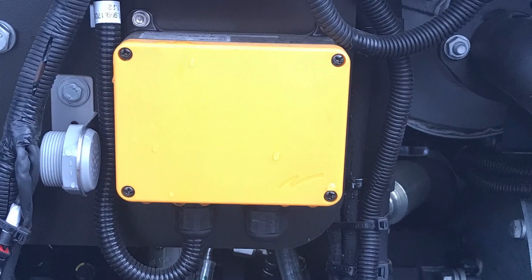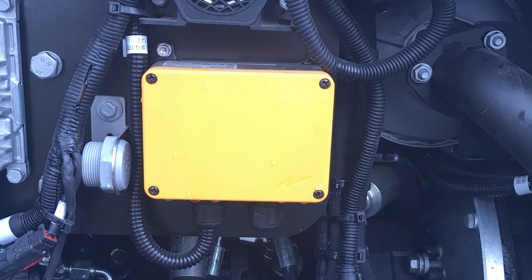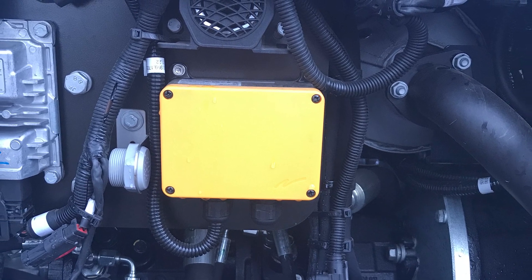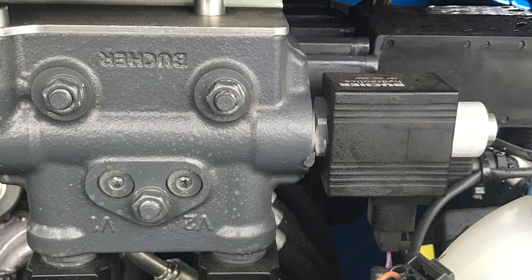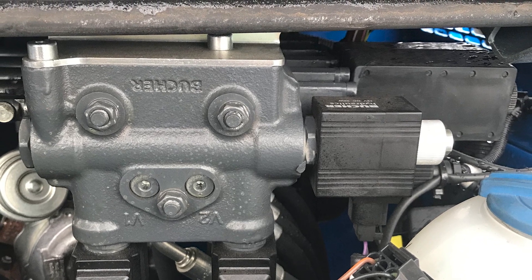The RGM Plus system uses a receiver box which is mounted in the rear of the machine behind the rear access doors. The receiver box contains all the electronics necessary to relay transmitted signals from the handset to the specialized valve bank. The specialized valve bank activates specific hydraulic actuator functions necessary for the mounting and dismounting process.